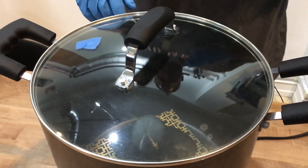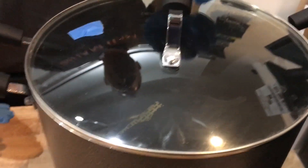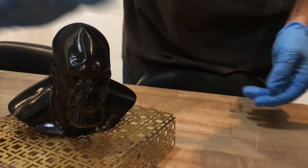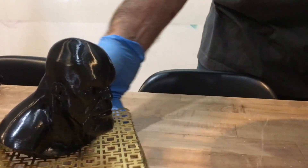It's been about 20 minutes to half an hour. I can already see through the top that the piece is shinier. This should really be done outside — I'm going to run the part outside to let it evaporate and not harm the employees and myself in the studio. The lid will have some vapors on it, so be careful. The base might be a little hot. Don't touch the model — let it sit for a good 10 to 20 minutes so the outer surface hardens, because it's actually soft right now. If you touch it, you'll get fingerprints, but you can see the wonderful results.